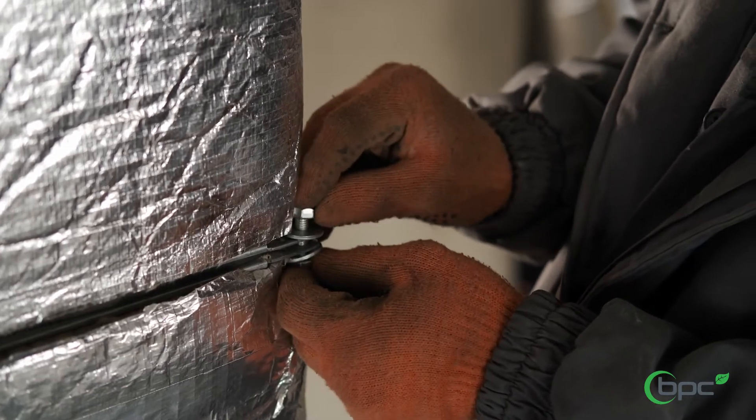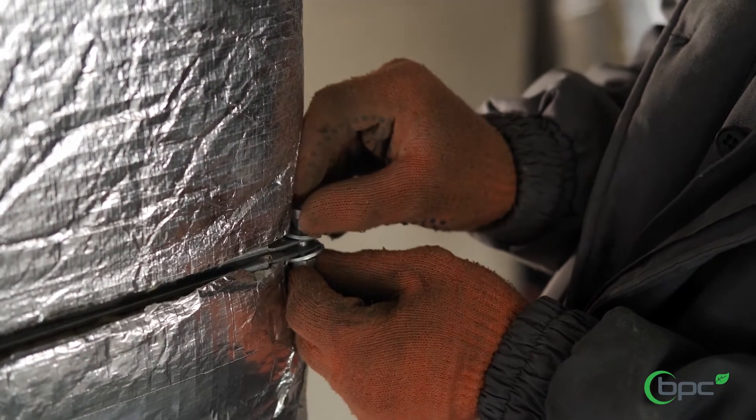The more you insulate, the more you need to ventilate. Effectively nowadays with new build properties, or even retrofits where people are using huge amounts of insulation to keep the home warm, it's not only insulation within the fabric — if you take glazing units where you've got double or triple glazing going in, you really are building an airtight box. If you don't have sufficient ventilation, you're asking for condensation and mould build-up, and the air quality inside that home is not good for the fabric of the home or for the people within it.